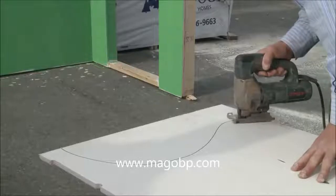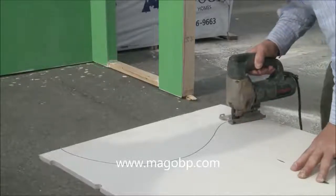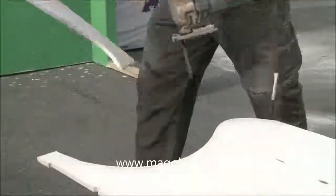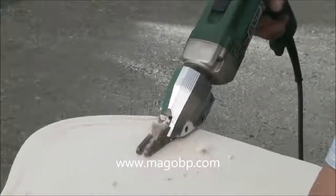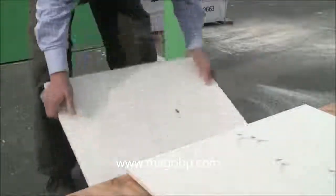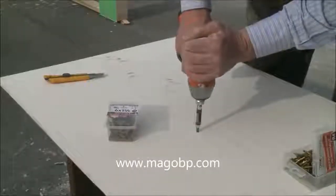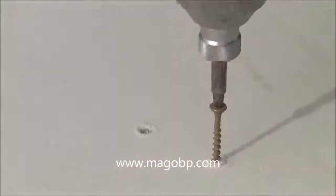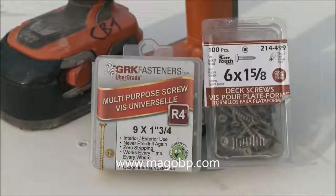Through this demonstration we were working with 12 millimeter half-inch board. This can be cut with a jigsaw, shears, and score-and-snap like traditional drywall. Also screwing with deck screws and with GRK screws — the important consideration is that the screw has a self-boring head.